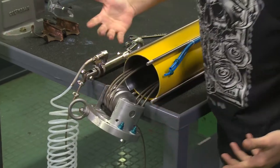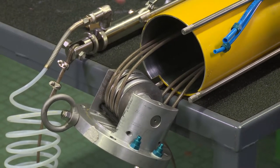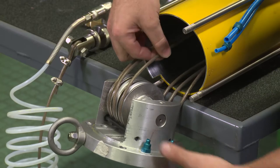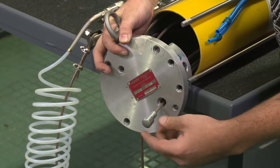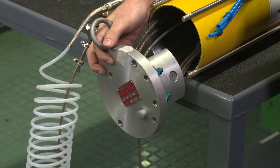Now at this point you expose a three pulley cable system inside the balancer. If you're having any issues with your cable, this is where you go to replace it. You remove it from the hook, pull it out through the inside of the balancer, and it will come out the back of the plate. To install the new one, you'll do the open end through the plate so your stopper ends up here, through the three pulley system, down to your hook.